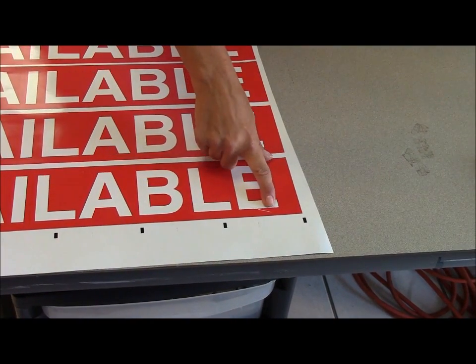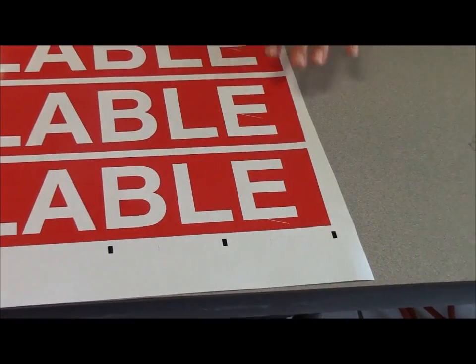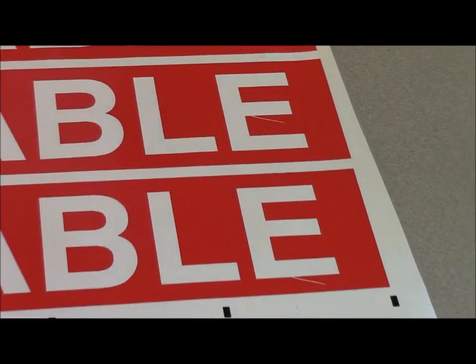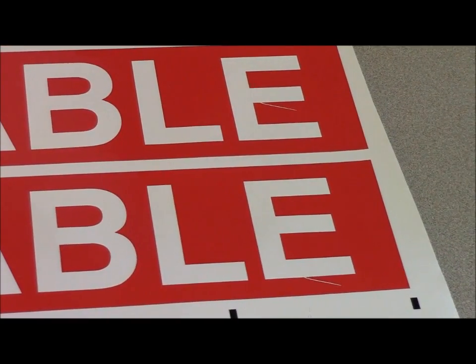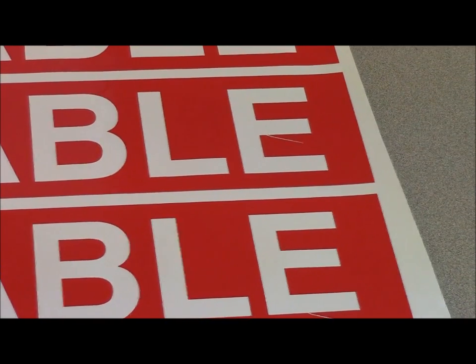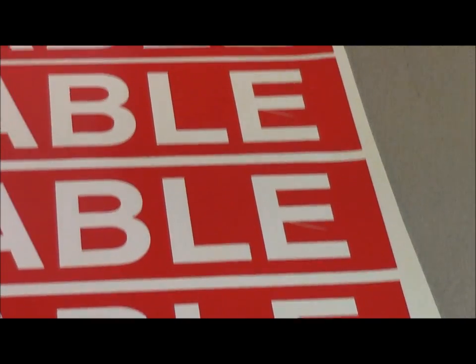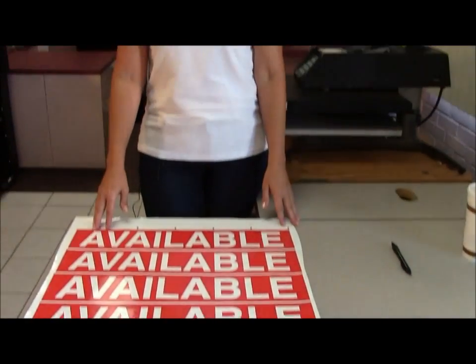What I'm seeing is these little streaks down here. It tends to be on every one of my E's, and then I have it again on this side over here. I'm thinking that this particular situation is most likely going to be something that has to do with my cartridge. So I've checked my vinyl, I'm troubleshooting each and everything. The first thing I've done is check the vinyl to make sure there's no issues with it — there wasn't. So now I'm going to go to my cartridge.